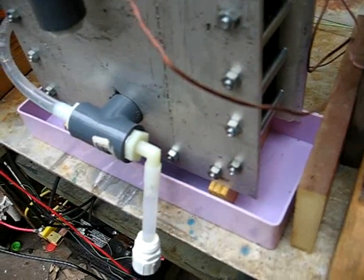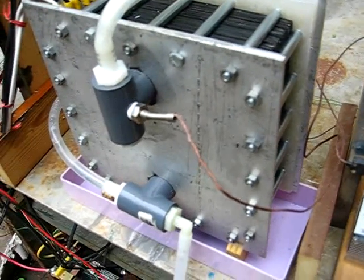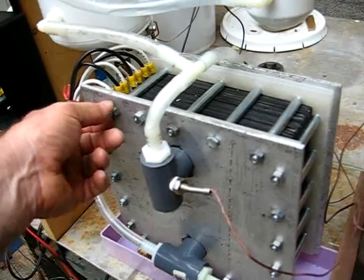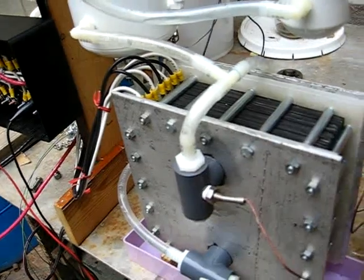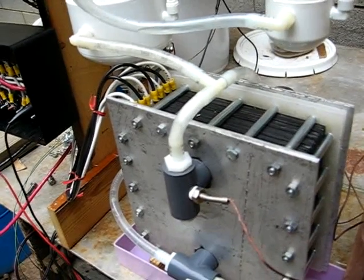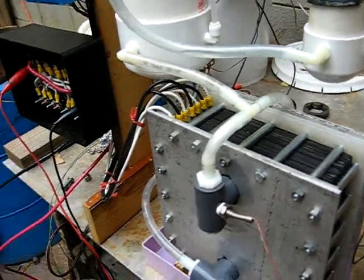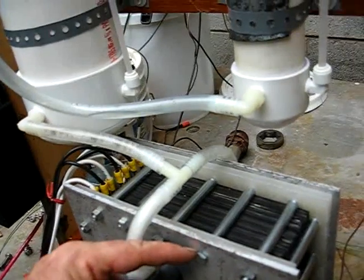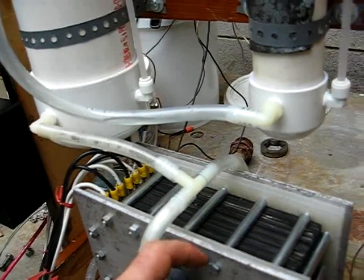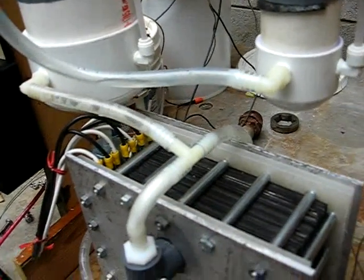The aluminum plates are likely isolated from the rest. You've got vinyl hose sleeves on the bolts. The truck is going to have a tray similar to this one to catch leaks. Since I put the fishpond liner gaskets in, it has not leaked even though the bolts loosened up. This has gone through four heat cycles. After the third heat cycle I put blue Loctite on the nuts rather than use lock washers. I had lock washers on there at first, but it was making little aluminum shreds and I didn't like that. On the next one I make, I'm going to put star washers on the head side of the bolt so it stays stationary and I can just tighten the nut.